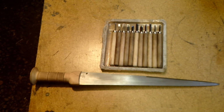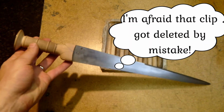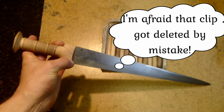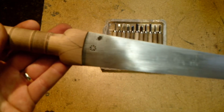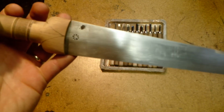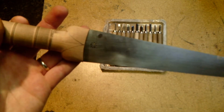Next episode in this series of our Scottish dirk build. On our last one, you remember, we went ahead and got the handle fit to the blade. I've got everything fitting pretty good across where this junction of the hilt to the blade base is. I'm happy with it now. Again, the blade is shaped in a crescent form across the bottom, and the handle correspondingly to match. I just slowly remove wood and metal till I get a nice tight fit across there.